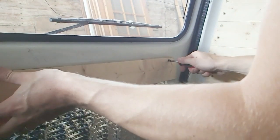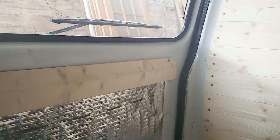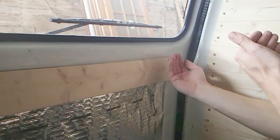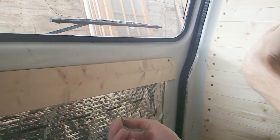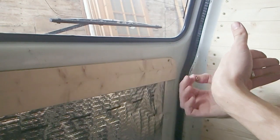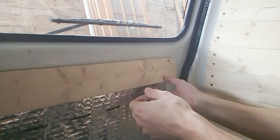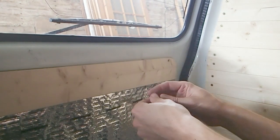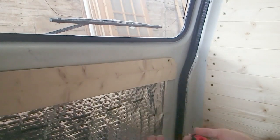The reason being is that if you're using a drill to screw your screws into the cladding, you can find that once you get in really tight into the metal and the wood, the screws start pulling their way back out of the pilot hole, and they actually tear a bigger hole out of the metal behind the cladding here. And then what happens is your screw will just keep turning and turning and turning, and it's got nothing to bite onto.